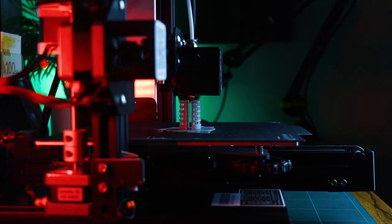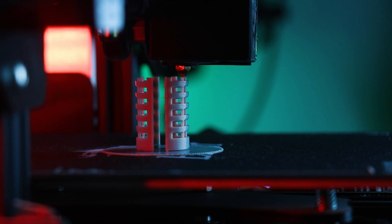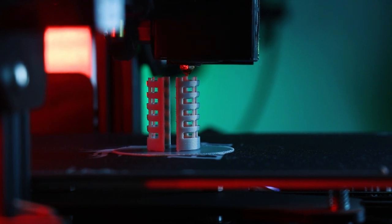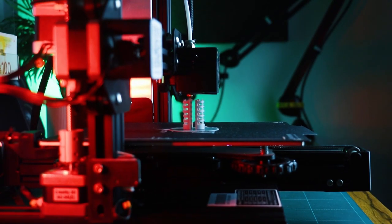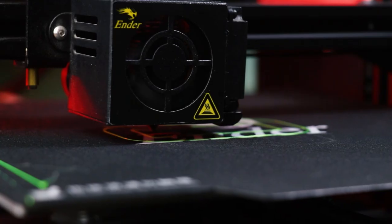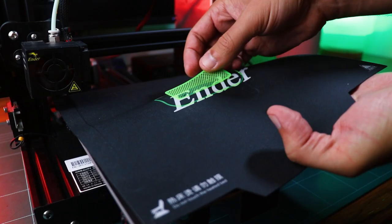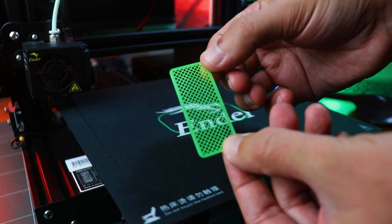The microphone body tube was printed at the default medium 0.16 mm layer height, upside down on the raft as I said, and the Z seam on the side of the mic. Otherwise you might get nasty blobs on the grills. The rest of the parts were printed at the finest default layer height of 0.12, although eventually I did print the pop filters with the 0.16 millimeter height in three layers.